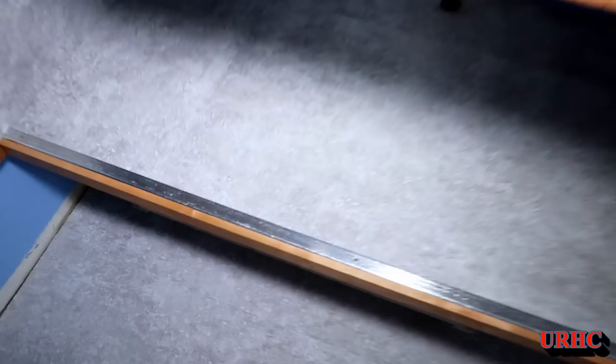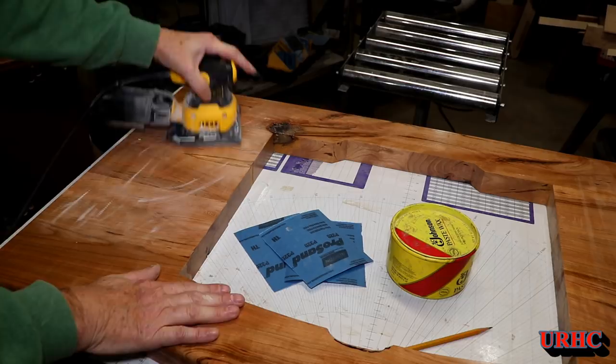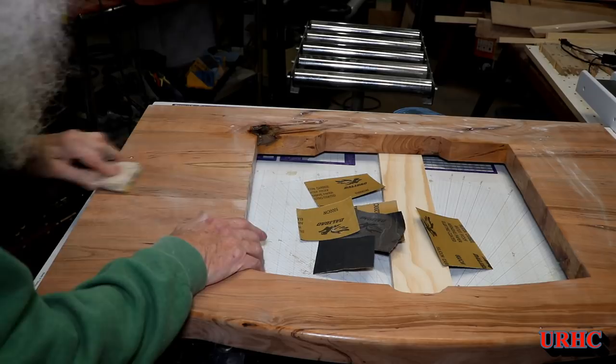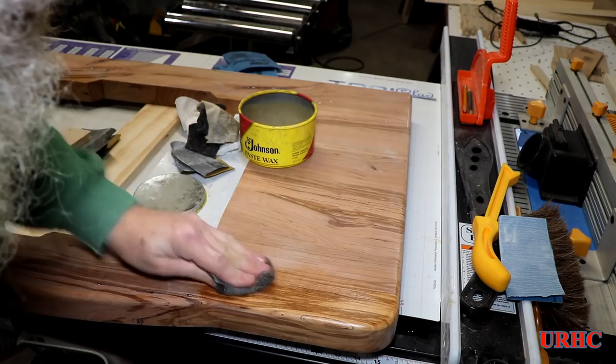You can see the little hidden step stool — you really don't notice it. Now it's time to finish up the top. It's only been set for about a week and I'm going back to sand it with 320 grit. After four coats, this Polycrylic really takes about 90 days to fully set up. I'm going to have to come back over it again — sanding with 320, then 400, then 600, then 800, then 1000, then 1200 to get it the best I can for now.